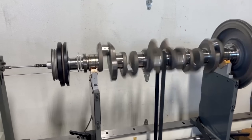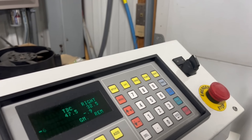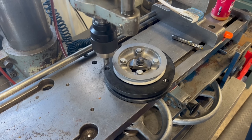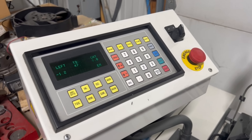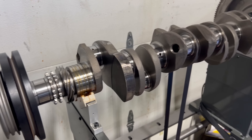Finally, we spun the crankshaft on the balancer, as well as spinning it with a flywheel, pressure plate, and harmonic damper installed to double check the entire assembly. It turns out the damper was around 6 grams off, but after drilling a quick balance hole in the proper location, the overall balance of the assembly was brought to within 1.5 grams. With that wrapped up, that's all we have for this week. Thank you for watching, and we'll see you in the next one.